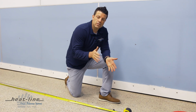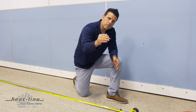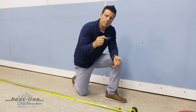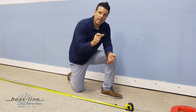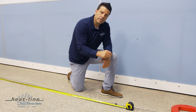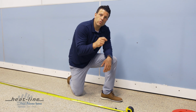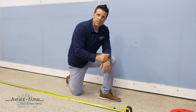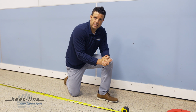So this is the next most critical step. We're 200 inches right to where we bumped into the backside of that pitless adapter. And if you remember earlier in this video, we talked about not having that end seal inside the pitless adapter. So what we're going to do now is take that 200-inch measurement and subtract 3 inches, and that will ensure that that end seal ends in the pipe right before the pitless adapter. So overall here, we're now looking at a length of 197 inches.